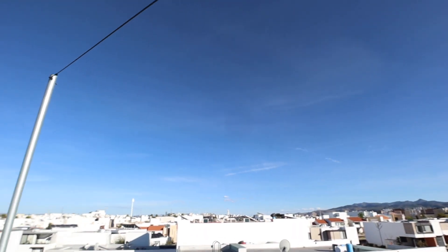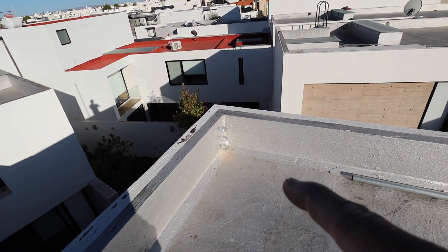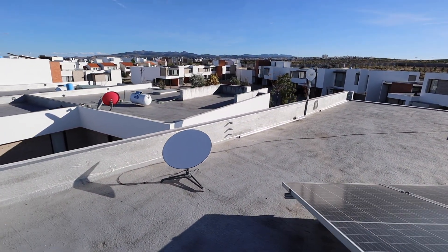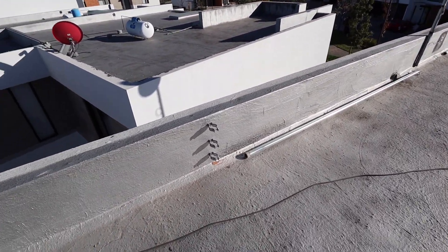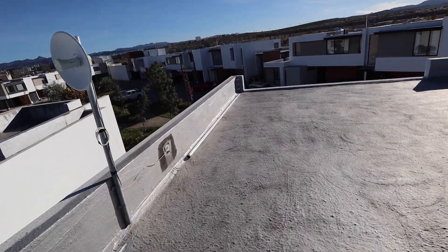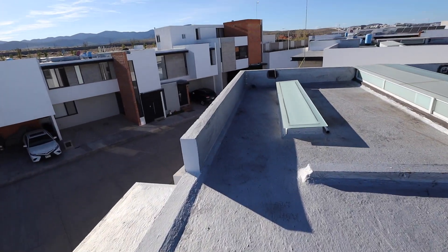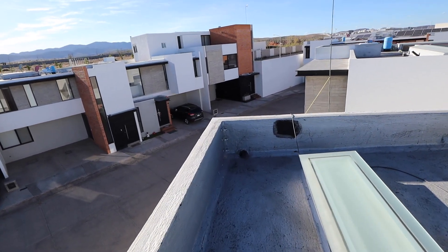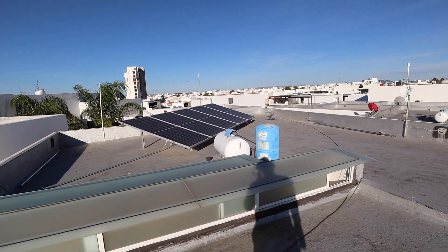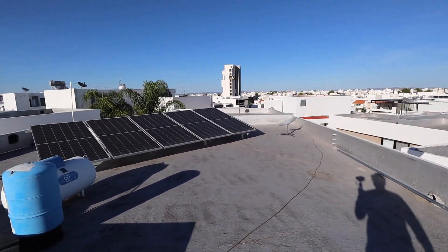I think I can give it more tension, but not today. And this one here is pole number 4 — this is the back right corner. We're coming back to the middle. That's the Starlink satellite dish. This is going to be pole number 5. Working my way back to the front, this is pole number 6. And then we'll complete the 40 meter loop, coming right back to the front, where I'm going to put the 4-to-1 balun. So that's the look of setting up the horizontal 40 meter loop, or sky loop, on top of a roof.